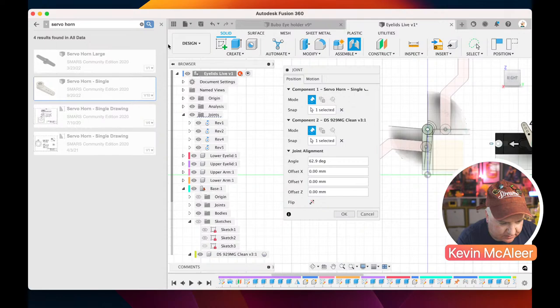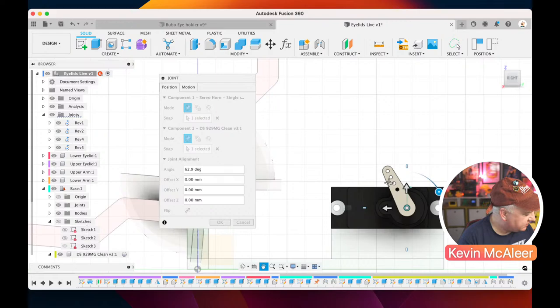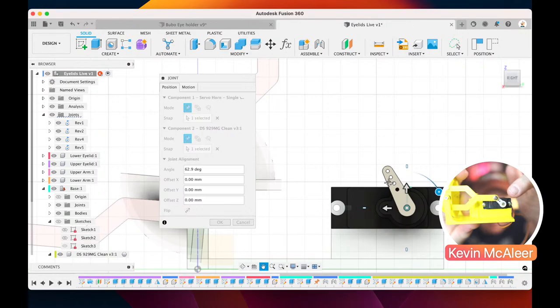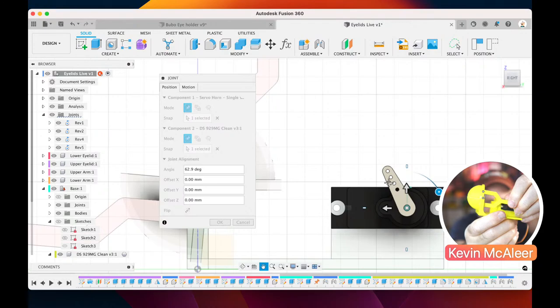and I then just use the pan tool to look correctly. What you'll find is you need the servo to be, got mine here, if I zoom in there, you can see that it's at an angle, leaning towards the eyeballs, and that's because when the eyeballs open up, if I can pull this one back on here, you'll see that pulls them back, and it's just past 90 degrees when it's fully open there. So let's just set that to be whatever it is to begin with.